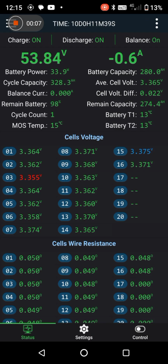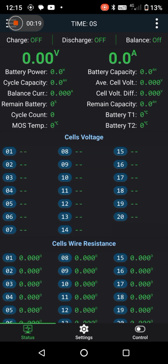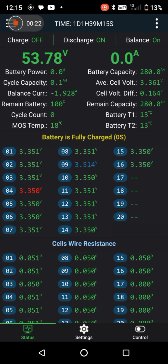So the cell voltage on the left bank is still slowly ticking down. And I go on to the right bank with the problem child of cell number 9. Nearly there to the 3.5 volt. Cut back in the recovery voltage, so it'll be interesting to see now that there's not a massive delta in the voltage, the difference from side to side. It'll be interesting to see how many amps flow from one side to the other.